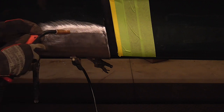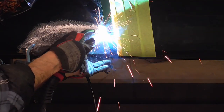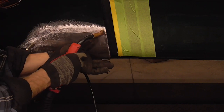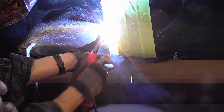When welding, you can put the cone right down on the work and use this edge as a guide. We're going to set it right there on that edge at a 45-degree angle, and zap it. And that's good for our first weld — now it's warmed up. We can just go zap, zap, zap, and hopefully we'll get that edge. And that's good — we got the edge nice. It was nice and heated up and we were able to get it.